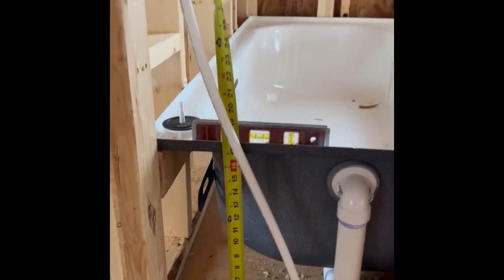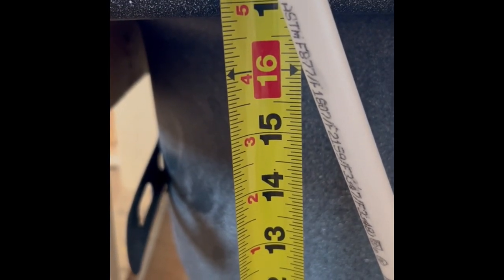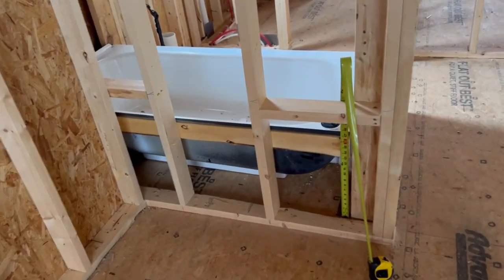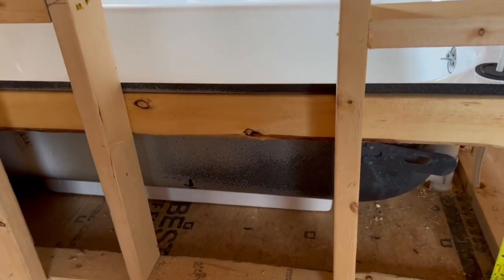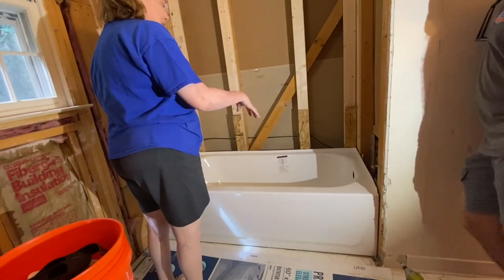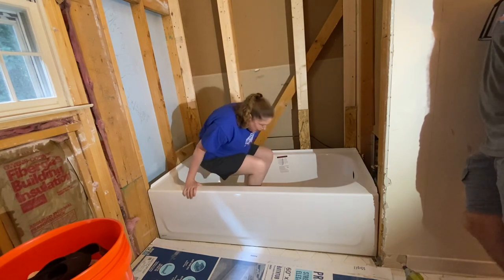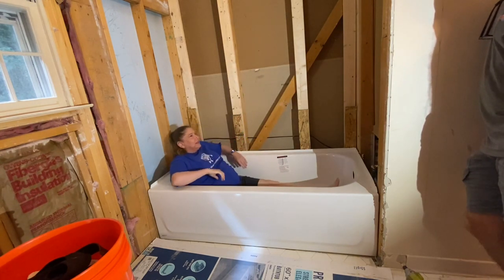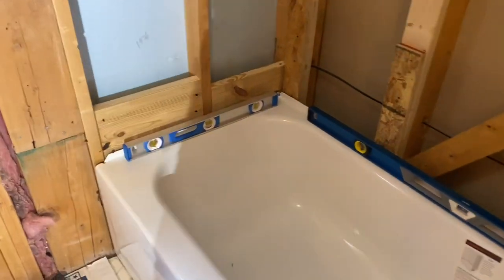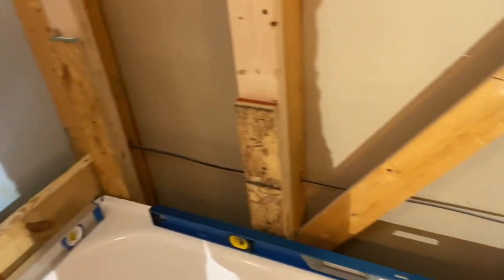The best thing to do is throw a level on the tub, then get your tape measure off the floor and measure to the bottom of that lip — then you'll know how high to set the top of your ledger board. A look from behind the tub will complete the picture for you. This ledger and the way the tub sits on it — it's so important to get this right. The tub is rock solid; we're going to read the levels on all three sides and make sure we're spot on before we build that waste and overflow.